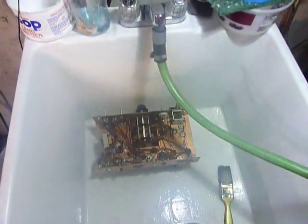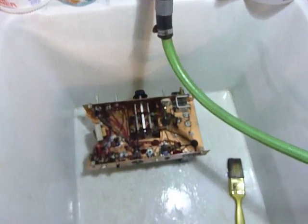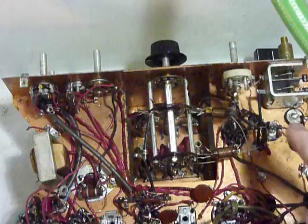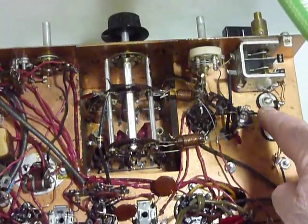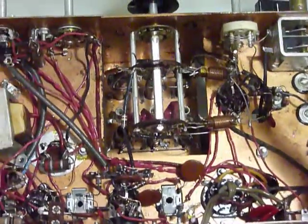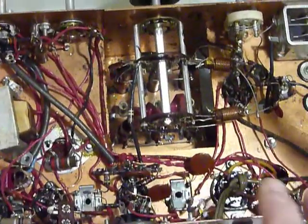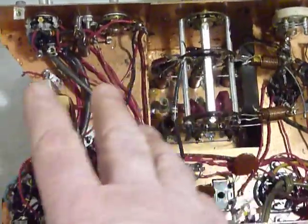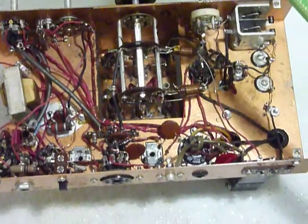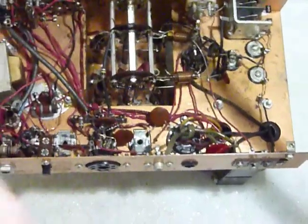Okay, you can see that wire there — that's one of the extra ground wires I was talking about for a redundant ground system. These redundant ground wires run through the whole system — all the ground connections, the ground lugs, the ground connections on the tubes, the ground connections on the jacks on the back — all connected together as a redundant ground system.